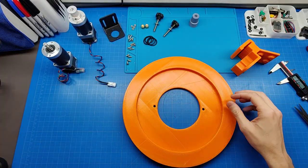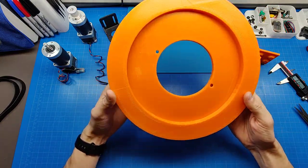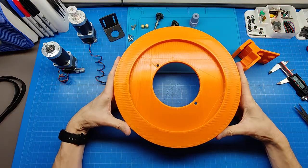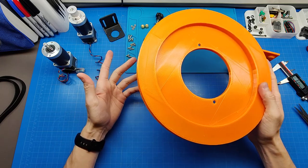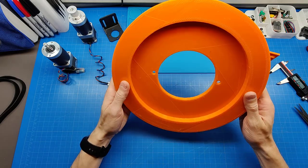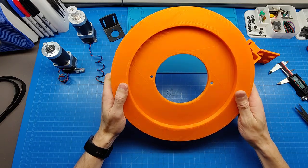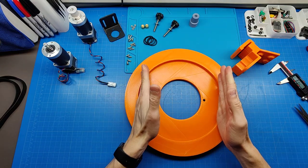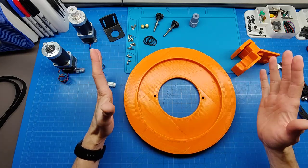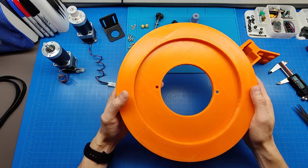And as well as for different diameters of the telescopes, you might need to print a different diameter of wheel. I believe even for a 12-incher, this diameter of the wheel will be sufficient. So if you have an FDM printer with a 300 millimeter print bed, this would do. This specific wheel might be a little too large for 6-inch or 8-inch Dobsonians, because the tube will be much narrower than the wheel itself. It still will likely fit the Dobsonian mount box itself, but it's just gonna look a little awkward, right?